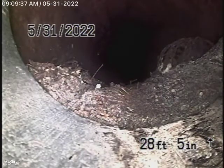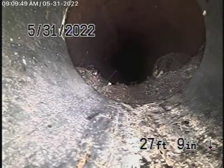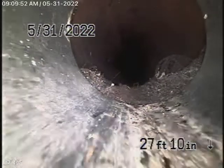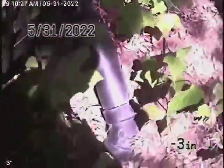It's hard to tell whether the roots are getting in from the coupling or from the lining — that's really not supposed to happen. As we come back, it returns to ABS plastic that looks like it may still be in the public works area, and that should have been a six-inch pipe. Coming back here, this plastic piping is in good condition, running underground — nice and clean. The ABS plastic coming up at the clean-out is really supposed to be cast iron pipe, but it is functioning and draining, just not done correctly.